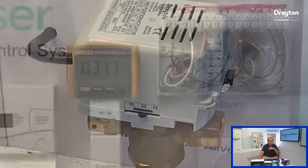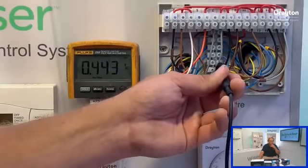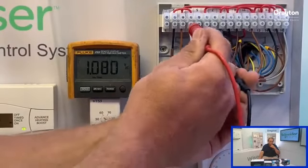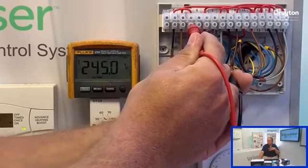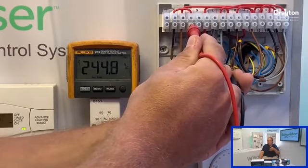So we'll get the system in the right condition. So central heating on the programmer, and there we go. That's the telltale. So we're not calling for water, but for some reason the valve is not moving over. Now it could be that there's an obstruction in the body, like we had on the last scenario, that's physically stopping the valve moving past the mid position.